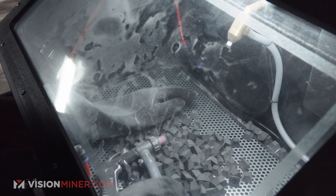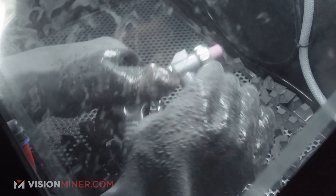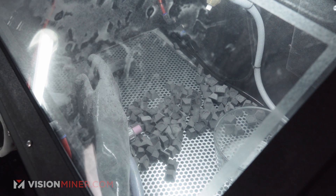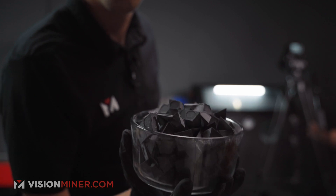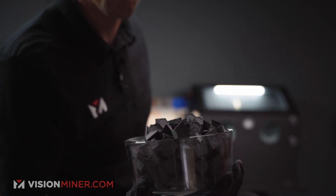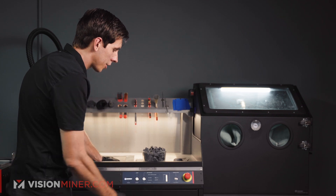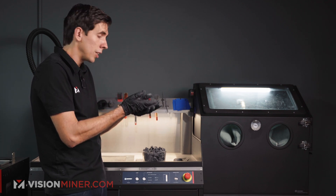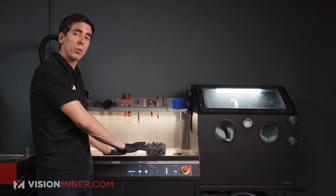I'm going to take them and jostle them a little bit to get most of that glass powder off before I reach in and gather them up, looking for any extra areas that might need a little more sandblasting. I found it easiest to come in with my bare hands — do want to watch for the back corner because little parts can fall back there. Now this thing's really finished moving all the powder into the sieve unit, so I'm going to press this button again and it's going to switch over to sifting — the whole unit is vibrating back and forth through very fine sieves, dropping all the ready-to-go powder down.